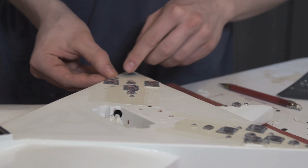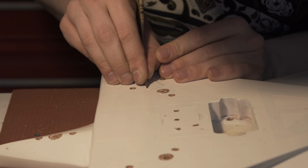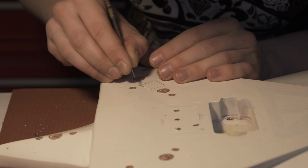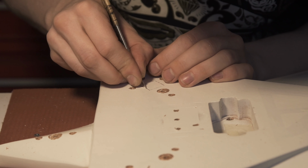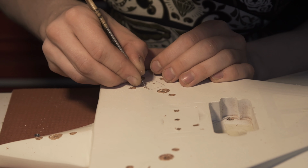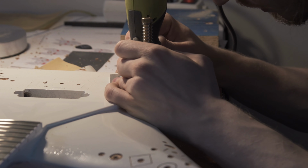And then it's a matter of just cutting out all the edges, just so I don't flake off all the paint, because that would be a royal pain. So I just score the wood and the paint ever so slightly, then I use my multi-tool with a little router base to cut everything to the right depth.